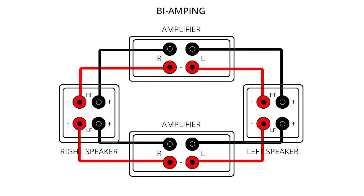Now let's talk about bi-amping, which is the next logical step after bi-wiring. To bi-amp, you have to bi-wire. Bi-amping takes things one step further by using a separate amplifier for the bass connection at your speaker and another one for the treble connection. Let's talk about passive bi-amping first — it's what you typically see when bi-amping is discussed and it's the most common. With passive bi-amping, you are still using the crossover parts of your speaker to send the correct frequencies to each speaker driver.